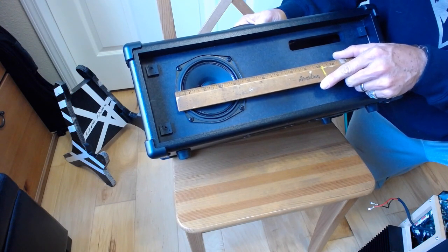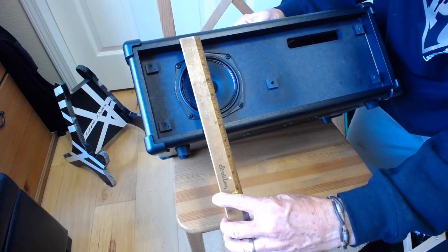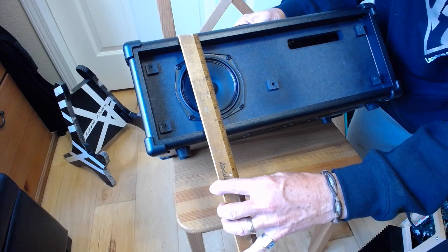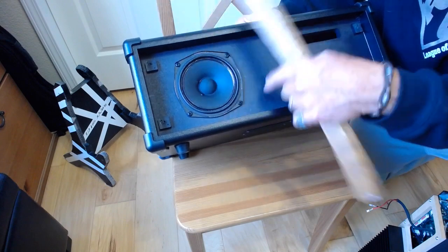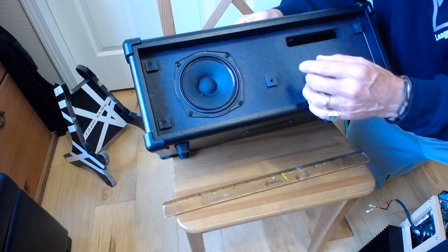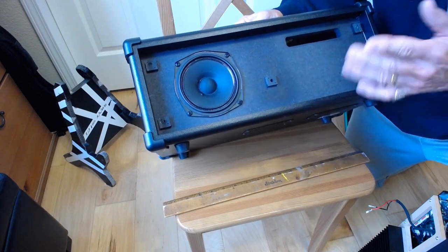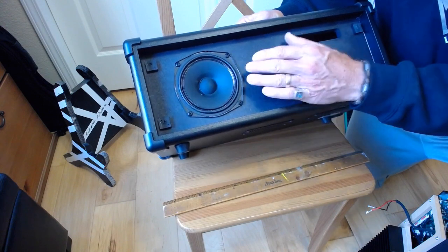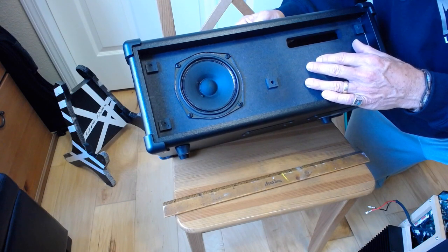This is a 5-inch speaker. There's room in here for a 6-inch speaker, although with the dimension of a 6-inch speaker, the mounting dimension is about 6.5. So you'd have to do some trimming or use an offset ring to seal it up to mount to. But I thought it'd be fun to put two speakers in here. Even if they were 5-inch, Eminence makes some small 5-inch. Eminence also makes a Cajun 6-inch speaker, which is good. But to put two in here, you'd have to have both at 4 ohms and run them in series.